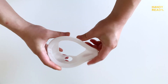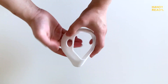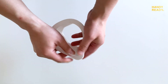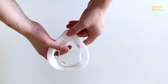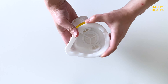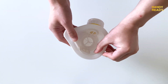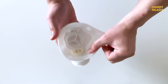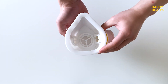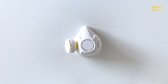The number one key obstacle for any kind of mask is the seal. The mask must have a proper seal or else why bother wearing a mask at all? A proper seal has to do with a lot of things: the fit and sizing, then there's the tolerance for when you speak and your facial movement, moreover the comfort, and last but not least, to keep the consistency — no post-production or add-ons after the mask has been printed, such as adding foams, gluing, or stitching.